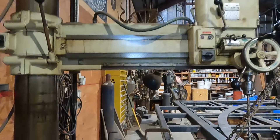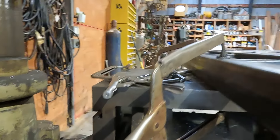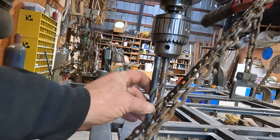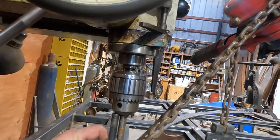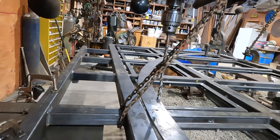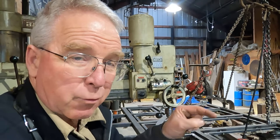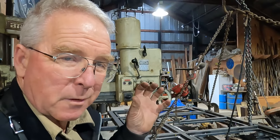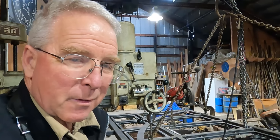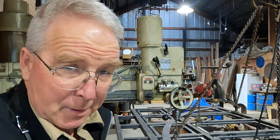It is close to level. I can clamp it sort of lightly to the table so I know that this drill bit will be going down through square. I've been worrying about this because I just had this idea that I wouldn't be able to get this thing far enough down for a regular machinist bit to do it. But happily, I have that bit — I think it's 12 inches. I use it for drilling through column caps, metal brackets, where you need to shoot through a 6x6 post and hit the hole on the other side. A bit like this is the one to use, and I was able to get it just sharp enough to push it on through this piece of tubing.